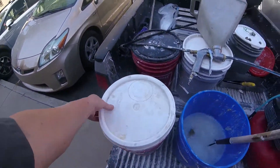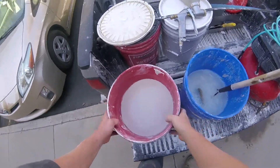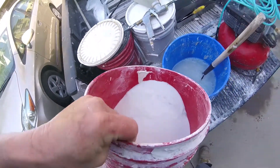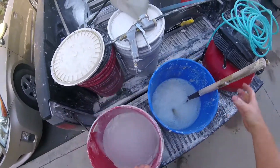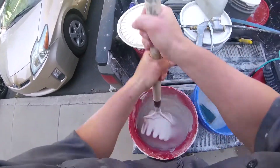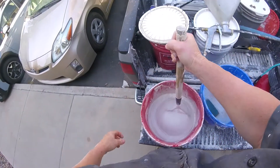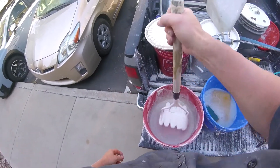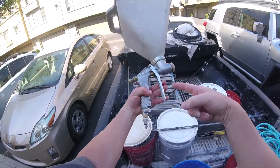Material consistency: I'm using a joint compound. I always use joint compounds. I keep my joint compound in buckets — when you go to the store you might buy it in a box, but it's easier to dump it in buckets and thin it down. I use a hand mixer because I work in the field, but electric mixers work great too. For textures, the consistency is like a heavy pancake batter — nice and creamy. You don't want clumps in your mud, so you have to mix it really well.